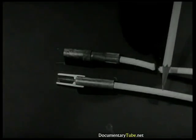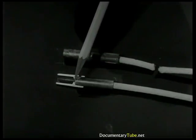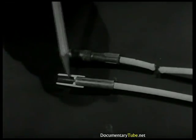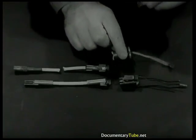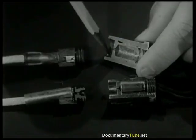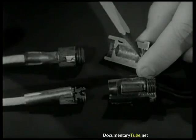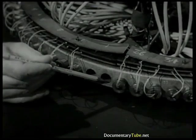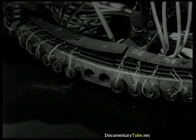These fuses burn at the rate of 70 seconds per foot and require two and one-quarter minutes to burn through. This allows the balloon time to rise above operating altitude. The fuse finally ignites the powder charge in the chamber of the jack switch connection. That mass production of these units is probably underway or contemplated is shown by the presence in later units of permanent mold cast aluminum plugs instead of the older completely machined steel plugs — the design of the plug has not been changed. When the plugs blow, the squib leads are severed; this prevents one set of plugs from short-circuiting the next plug. The flash ignites the fuses behind these holes.